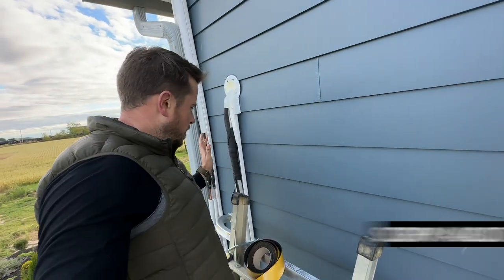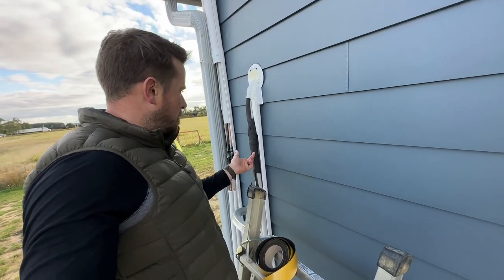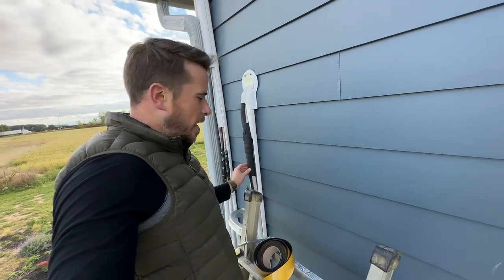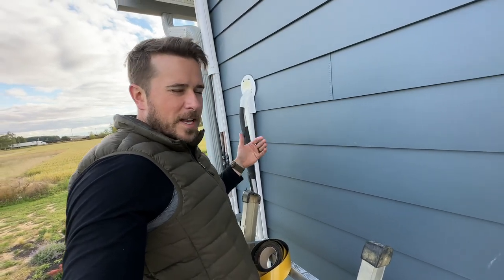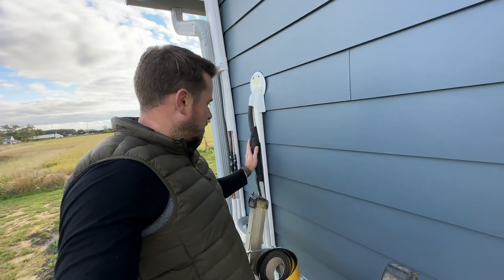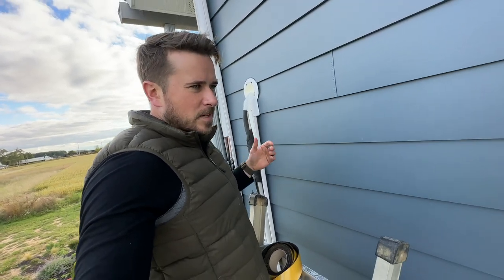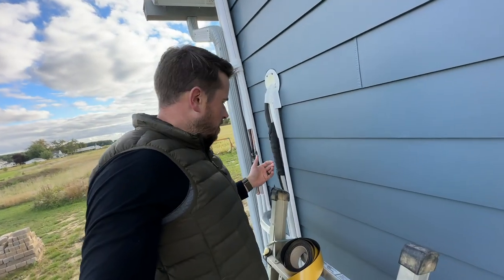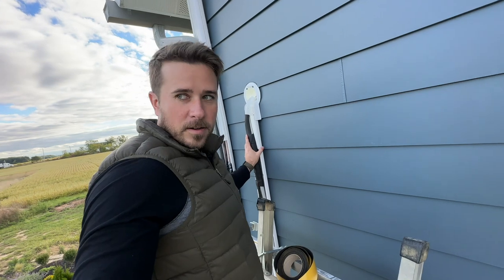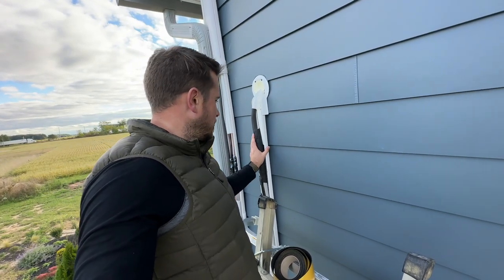Maybe this is overkill, I don't really know. I think I should have probably done this the opposite way — started at the bottom and worked my way up, so that the shingling would have been the proper way, as this is upside down now. I don't anticipate water getting in here, but if it were to ever get in and get onto this piping, proper shingling would be better. I tend to err more on the side of more rather than less, so as long as I get my cover on here and these are well insulated, that's all I'm really worried about.